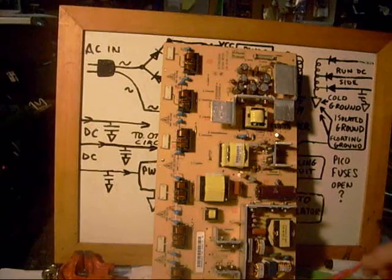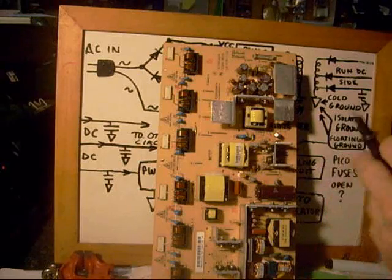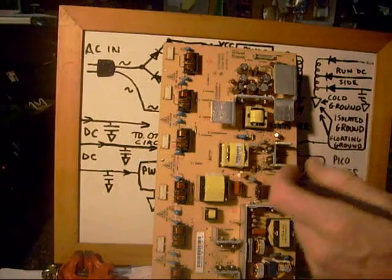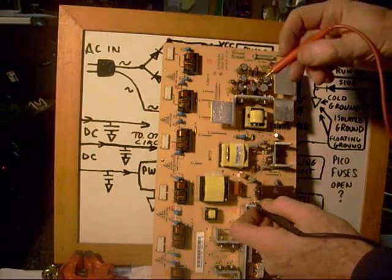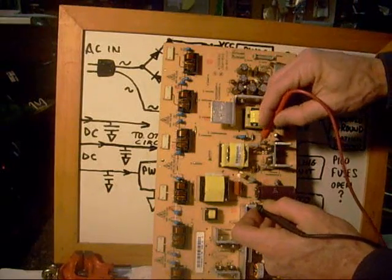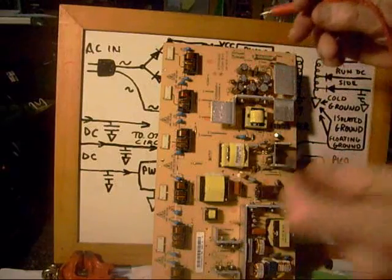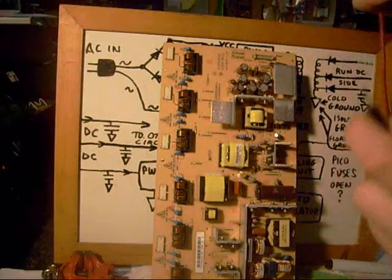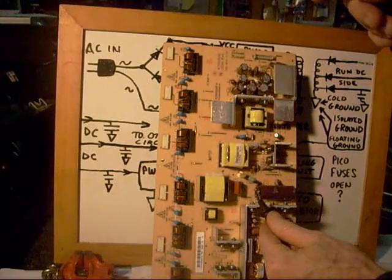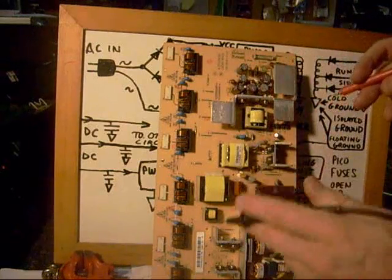In this part of the video, I want to talk about taking voltage measurements and why you need to understand there are two different ground reference points used when measuring voltage. A lot of times you'll open up a schematic and the manufacturer will have notes indicating what the voltages should be in various parts of the circuit board — for example, 10 volts on this end of a resistor and 5 volts over here. You always have to have a good ground reference point to measure from, and you need to make sure it's the correct one. The schematic may show it's okay to measure from the negative side of a capacitor, but what if there's a different ground you need to measure from?